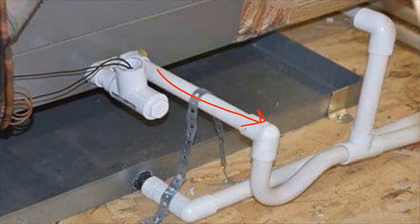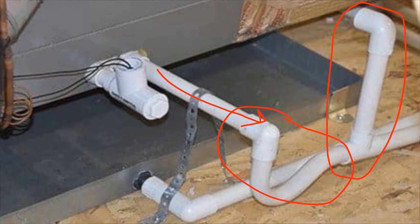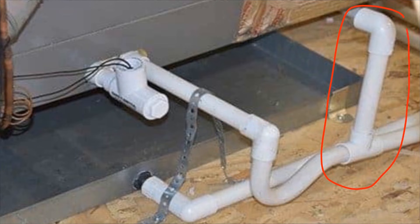Here is our primary drain coming through, with our P-trap — which we're going to talk about in a second — going into our vent. The reason we have this vent is so we don't get vapor lock in the lines between two sags. Whenever you have a drain line that sags across an attic, there's a chance the line can vapor lock, causing it to drain poorly or not at all — the pan can actually overflow because air is trapped between two pockets of water. The vent piping allows that air to escape so the drain can work properly. That said, fix the sags in the line; the vent will prevent issues from a little vapor lock, but proper slope is still important.